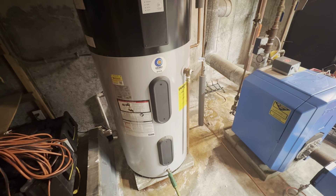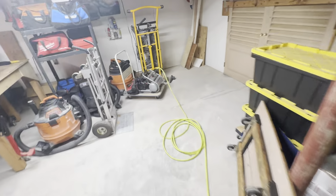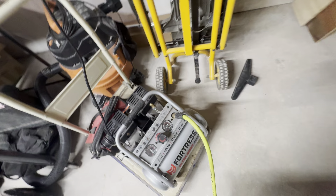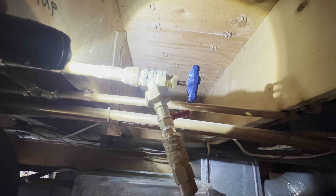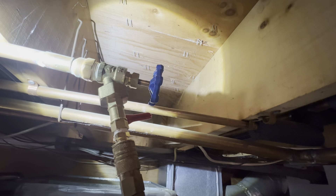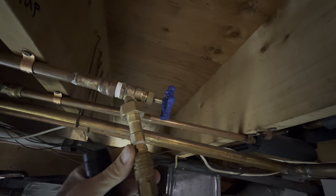This is how I'm doing it for about a $10 fitting. You turn the hot water heater off, then I've got my air compressor throttled down to about 15 PSI — you don't want to damage anything in your system. Here's the meat of this: I went into a hot water bib and got a sprinkler blowout fitting, which you can get for less than $10 on Amazon. I open the valve and back-feed about 15 PSI of air into the system.